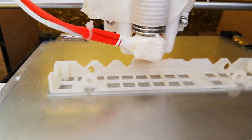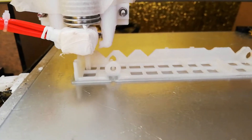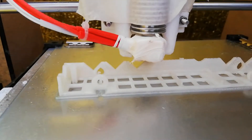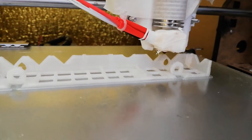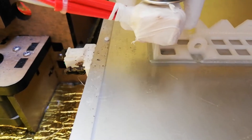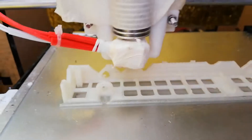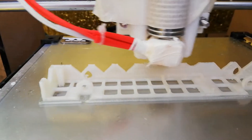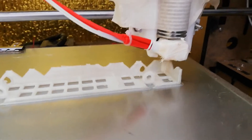It's currently printing at 0.32mm per layer — a very large number given the printhead diameter is 0.4mm, so it's pretty close to its limit. I'm also printing with zero percent infill, so if you look at the wall there's actually a small gap right in the middle, strengthened by little triangles I'm printing in the walls. I'm doing that because it speeds up the print — this doesn't need to be a perfect print, it just needs to work.